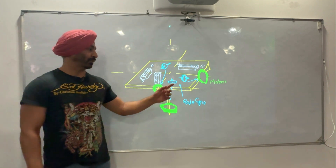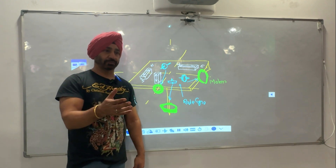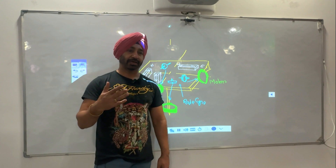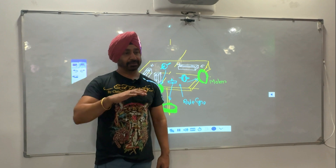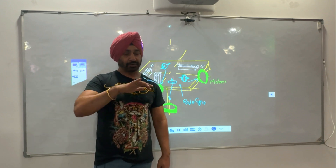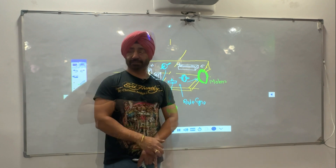The whole purpose of this platform is to keep your accelerometers always horizontal. These are called rate gyros because they sense any tilt — like in a phone you also have a gyroscope; when you tilt the phone that shifts the screen, that is a gyroscope. Obviously nothing is physically rotating inside modern ones; the technology is different. They are called ring laser gyros, RLG. In simple terms, they sense any tilt in any axis. A platform can tilt in three axes, and along each axis we have put one rate gyro. When it senses any tilt, immediately it sends a signal to the motor to make it horizontal again.